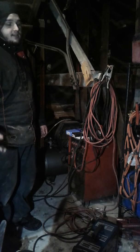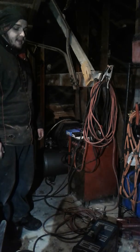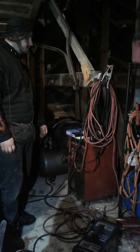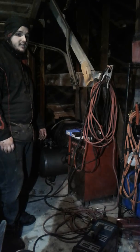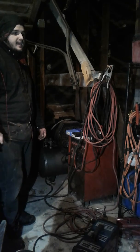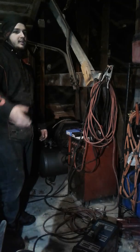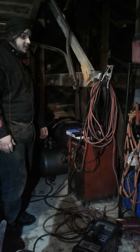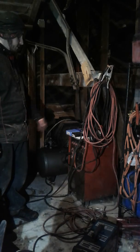The inverter is really light and portable — great for throwing in a pickup or the trunk of a car. The transformer machine sits at home in the corner by your bench. It'll work forever — I've heard of them surviving floods and all kinds of crazy stuff and still working. Old transformer machines just work and they'll work forever. They do have a 20% duty cycle and they're 220 only, which turns some people away.